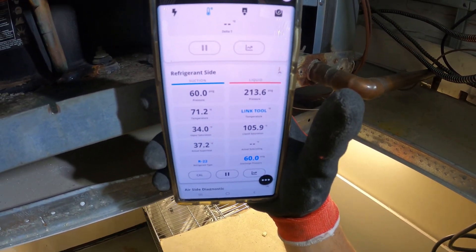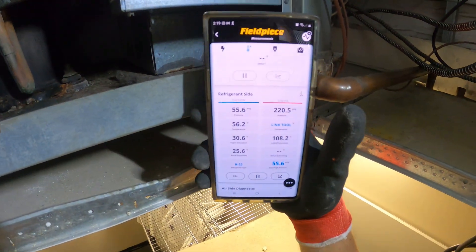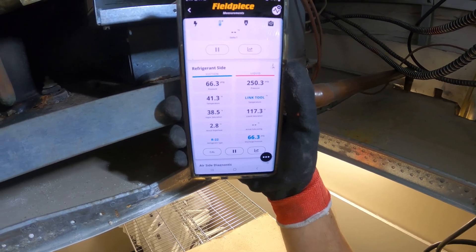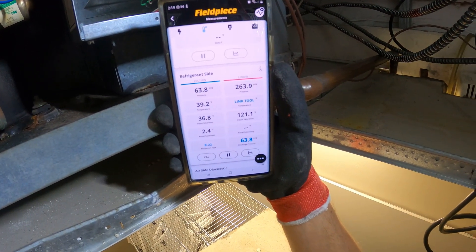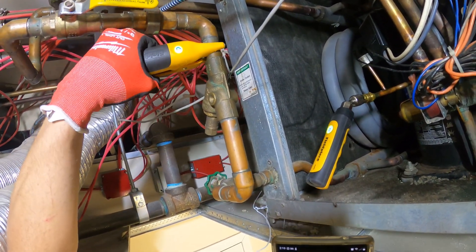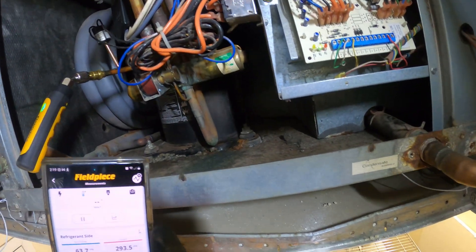208, 213. There's a water regulating valve here. The head pressure is climbing right now — 250. Listen to it getting louder and louder. See the head pressure is getting high — 290. So that was definitely high head.